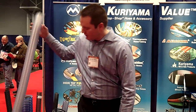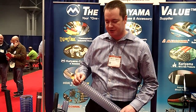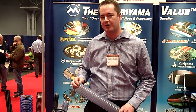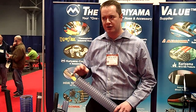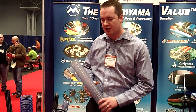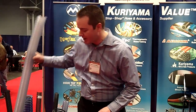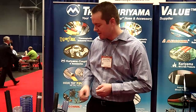Absolutely. A lot of material transfer hoses have an embedded grounding wire. It's very effective at dissipating charge to ground. However, charge can still overload the hose. It's good in about 80% of applications, but in very high static generating applications you need something that's a little bit better. Traditionally, the only alternative was to go to metal hose, which can be heavy and hard to work with. So we set out to develop a product that can work in any type of situation for static charge.